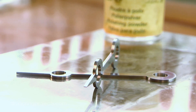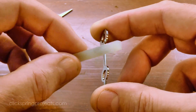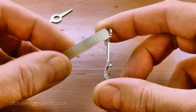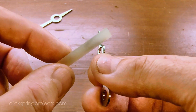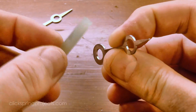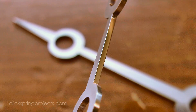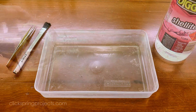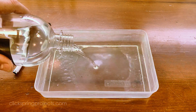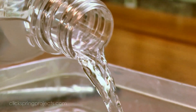At this point most of the hard work has been done, but as a last step before bluing, I'm using this fine abrasive stone to break the edges of the work and to give the parts a little more character. So I'm about to start the second bluing — the one that's just for appearance — so the parts need to be thoroughly cleaned.